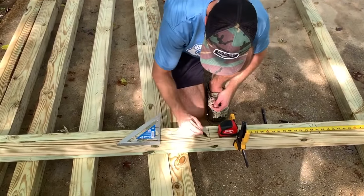And here's a look at the window trim installed from the inside. Now, although we framed these windows to be 2'6.5" wide by 1'2" tall, it's always a good idea to field verify each window opening so that we can cut our acrylic or plexiglass windows to the right size. So here I am checking the height, and then I'm gonna check the horizontal width of the windows, and after confirming them, I'm gonna actually cut my plexiglass acrylic windows to size.